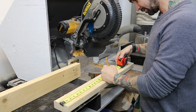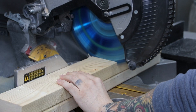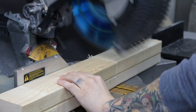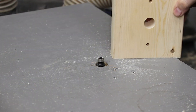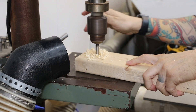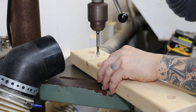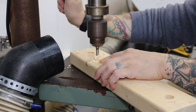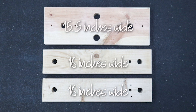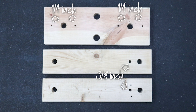After those are done, I cut the 2x4s. The length of these will depend on the length of your arms — I'm 5'7" and I cut my 2x4s to 16 inches. It's optional, but I round the edges with my router and a round-over bit. I need to drill a few holes into the 2x4: each one needs two 3/4-inch holes and a 3/8-inch hole. A lot of this is subjective — you can modify to fit your specific rack and body measurements.